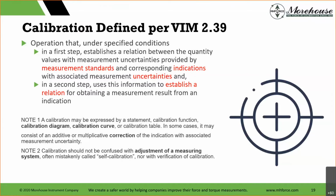If you want to do some more research on this, there are some good papers out there. Paul Reese wrote one, and you can also look up Deming's funnel experiment, which shows there is some danger when you keep adjusting a process. And that's all I really want to say for this beginner course: when you keep adjusting something, you say, I can tweak it, I can get it better and better. And all of a sudden, those little tiny adjustments, where you think you are getting good and pinpointing things, make a process that's otherwise in control go out of control.